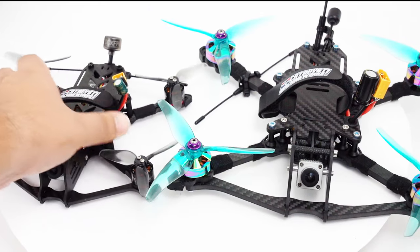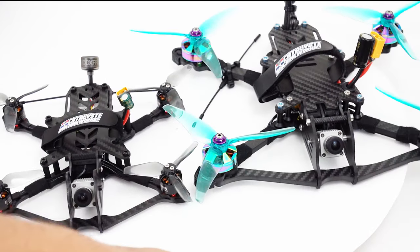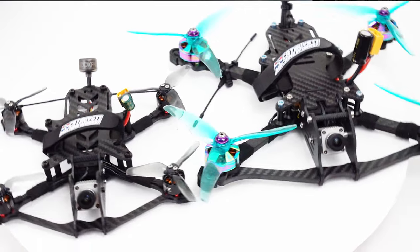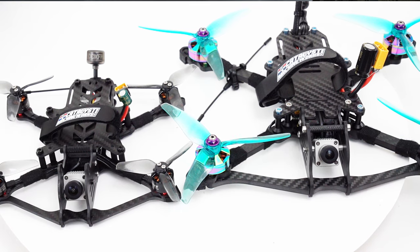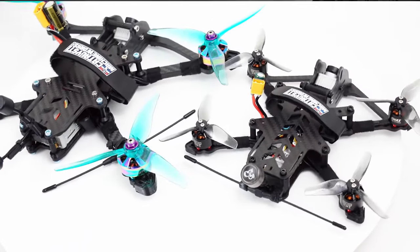Here's the 3-inch of this thing. You gotta have these back to back, right? Oh man, the feel of this. I went with a classic freestyle formula for this. This is the R6 Brother Hobby, but I'm using the classic 2306 freestyle size, 1750 kV. That really gives you a lot of control, a lot of power down low where you need it for freestyle to be able to make those maneuvers.